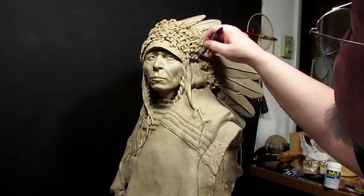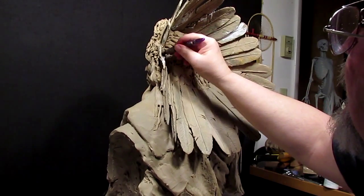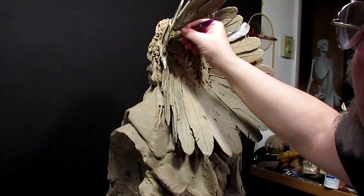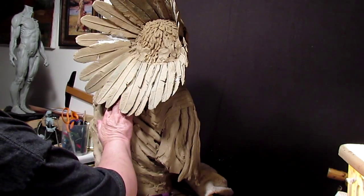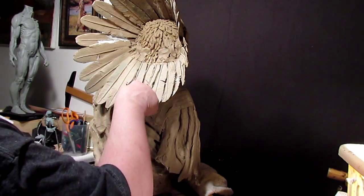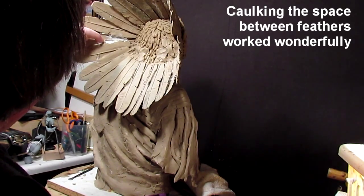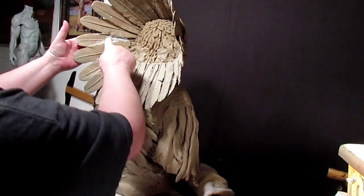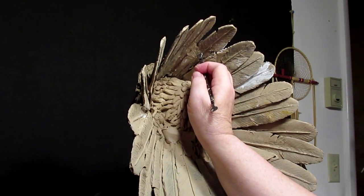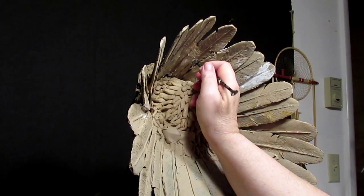It makes a little difference in how it looks but makes a whole lot of difference in the casting cost. You've got to have your holes filled because if you don't, they cost you money. What I've done is filled underneath these feathers here — I've got to fill a little bit more — so that they can just cut the tips off and cast them separate. This is the serrated edge tool that I was using before. Looks like that's what I made my detail with in the feather.